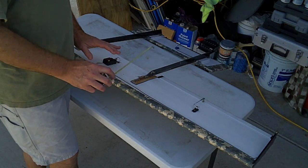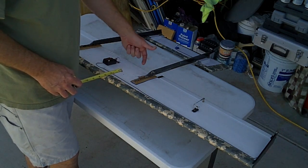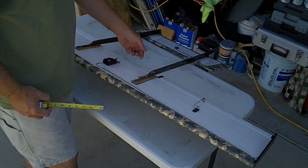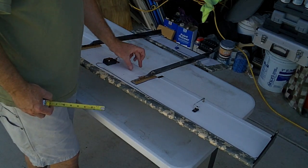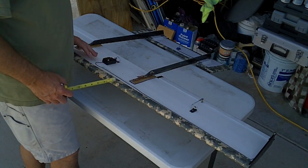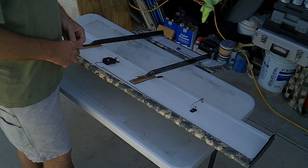And so actually, back up a second. When you're building the wing, you measure from the back edge. It's much easier because this is a fold, right? So measuring from the back end, we have a 3 inch and then a 6 inch is the location of those wood spars, those dowels.